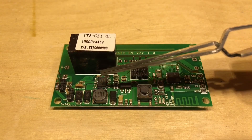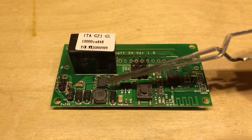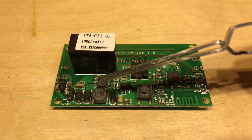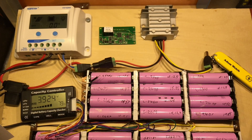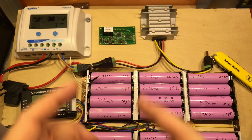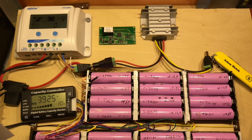Interestingly, there also seems to be another buck regulator here with an inductor and a diode right next to it. I need to find out more about this, because although the Sonoff website says 12 to 24 volts on the input, I'm wondering if it's tolerant to slightly higher voltages. I'd like to use it on my 7S lithium pack on the 24-volt side of the circuit — actually more like 28 volts, since I charge each group of cells up to 4 volts. Having it between the solar charge controller and the DC-to-DC converter should make it more efficient, because I'm turning off not only the lights outside but the DC-to-DC converter itself.